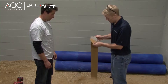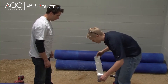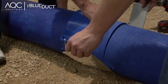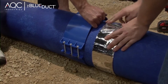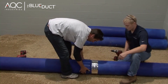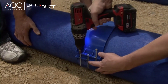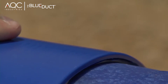Remove the backing from the gasket. One person will be on the left side of the horseshoe-shaped gasket that is underneath the already attached duct. Another person is needed on the right side. Using the clamp as a handle, bring the piece of pipe to be connected to the left side and set it into place. Wrap the gasket up and around the connection. Go over the entire surface of the gasket and inspect the overlapped seam. Slide the clamp over the gasket using a side-to-side motion — this will avoid the potential for the gasket to roll underneath the clamp. Tighten the clamp until the stainless steel inserts begin to deflect. You should not be able to fit a flathead screwdriver between the clamp and gasket.